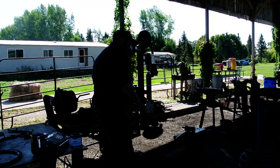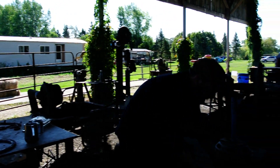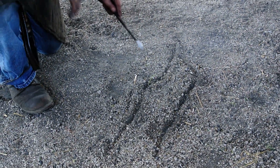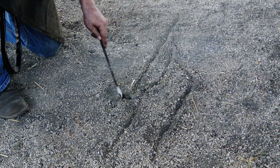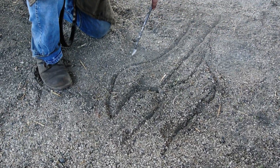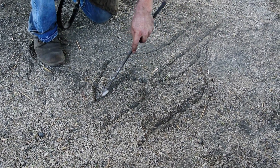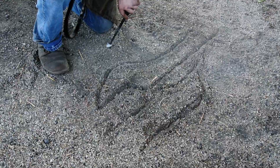So the notch is just kind of a locator. Let me draw it here. Here is one piece, and then I've got my other piece. This comes here, kind of like that. There's a little bit of material here that overlaps, and this gives you the greatest amount of thickness to start hammering — gives you more material. As these come down, that'll allow these guys to slowly join in before you get there. That make sense?